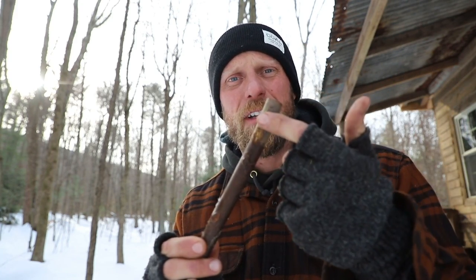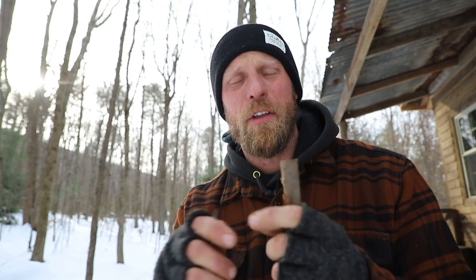And that's common. That's going to happen with this. If you just get after it and start drilling, you're going to split it out. And the reason for that is because of how a gimlet actually works. So a gimlet has a lead screw. That lead screw is the same as if we were putting a screw into the wall at home. It needs to get dug in, that's what's biting into the wood, and it's leading it through the piece that we're cutting. And then when it gets so far down, it actually hits the cutting edge.